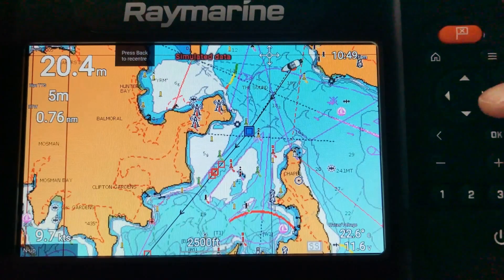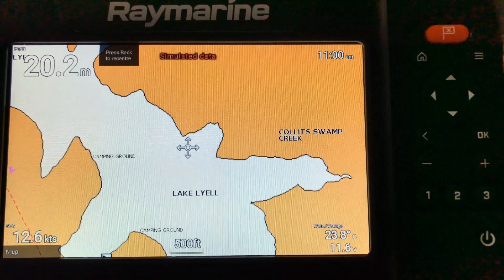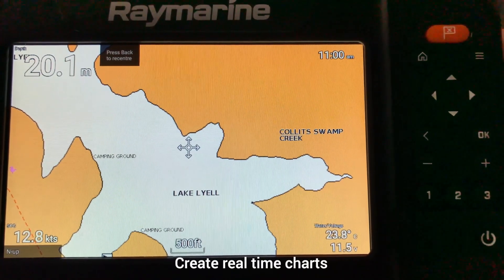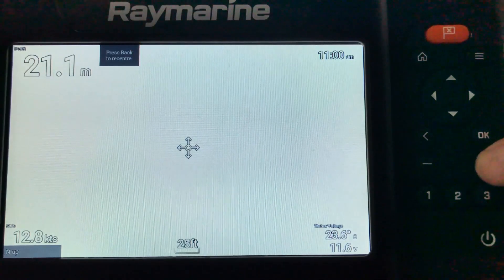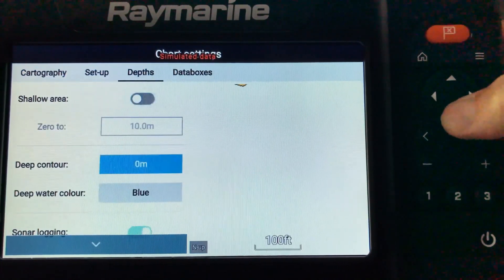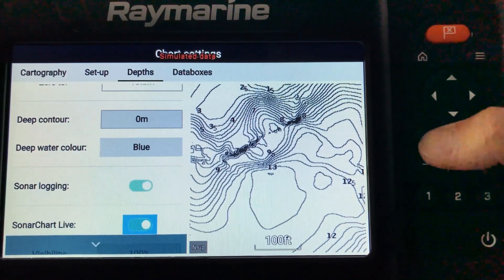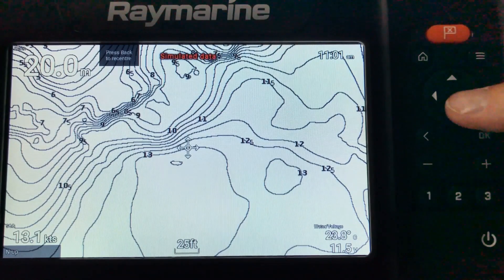Creating a Dock auto route is quite simple in this unit. Sonar Charts Live is another feature of the Element, which means you can create your own real-time high density charts. It takes raw data off your transducer and draws a new chart on your screen, saving it to the Navionics chart card. We're looking at an inland dam that has never had a survey — as you zoom in there's absolutely no detail because there's never been one. By going into Sonar Chart Live, we've run over this area and created a new chart. Go into the settings menu, then depths, then Sonar Chart Live, and turn it on. Now that previously uncharted area has quite a detailed map showing all the underwater structure.